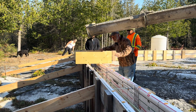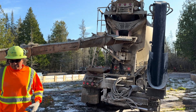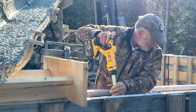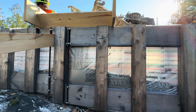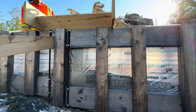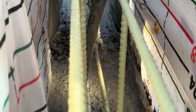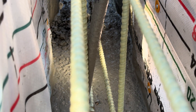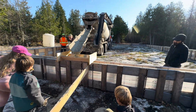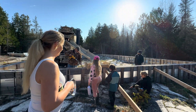The funnel was easy to pick up — we moved it 10 or 15 feet between pours. I didn't pour the deepest part of the form all in one go because I'd never used the Fast Foot fabric before and didn't want a nasty surprise. But in practice we could have poured even the tall part of the form right to the top. We did let it set up a little to get firmer and take some pressure off the forms, but that really wasn't necessary.